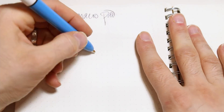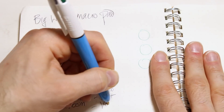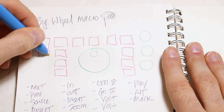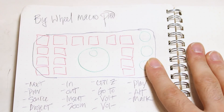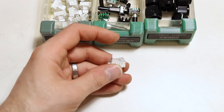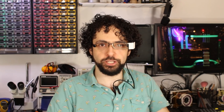Here's the project. I needed a custom keyboard controller with a big wheel to precisely navigate my footage. It also needed hotkeys for the most important commands so I could cut video with one hand and leave the other hand free. I decided I would hand-wire a few mechanical keyboard keys and rotary encoders to a Teensy microcontroller, and I'd use my 3D printer and Fab Lab's laser to build the body.